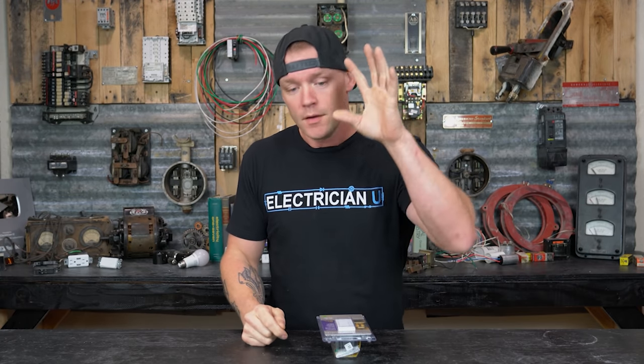So anyways, we're gonna turn the breaker off. We're gonna check with a multimeter, make sure the power is off. We're not gonna shock ourselves. And then you open up the switches.